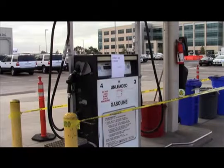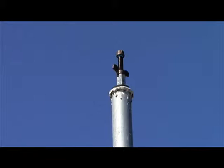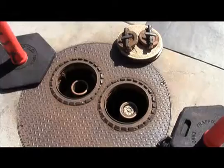As PV valves crack or open under 10 inches of water column, the valves must be removed and the vent risers capped prior to beginning the test. Additional requirements are the submersible fuel pumps be turned off and Phase 1 adapter caps removed. During this test, the executive order for the system requires all clean air separator or vapor processor valves to be closed.